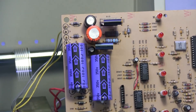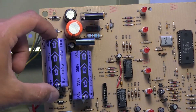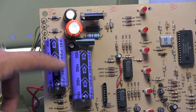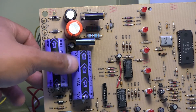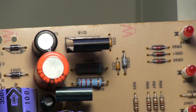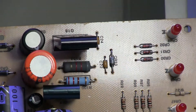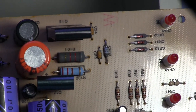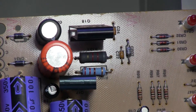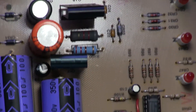Right here on the bottom — well, technically this would be the bottom right if we're looking at it from the front — we have a couple of big electrolytics: 350 volt. So this is probably going to have to do with something like the ringer generator; that's probably why they're so high. And 100 microfarad. Right here looks like we've got a couple of transistors — this one says Q18. So that looks like a transistor. We've also got a couple of big power resistors and another transistor. Maybe these are for voltage regulation because we've got power coming in right here from the transformer.